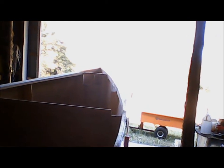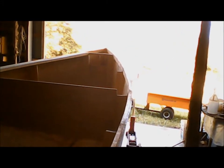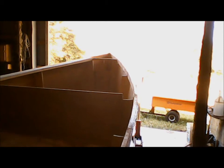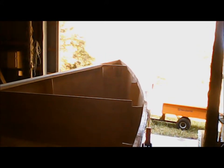So I'm going to get all my clamps stationed. I'm going to start at the bow and work from bow to stern along the starboard side with my 1x2s. I'm going to stage the clamps on the floor — that way it's a simple matter of reaching over and picking them up versus walking all the way to the bench. Just that little bit of prep work makes all the difference in the world.